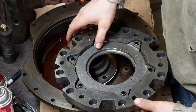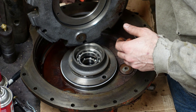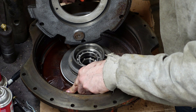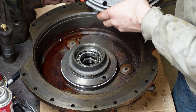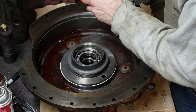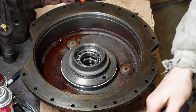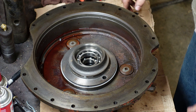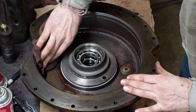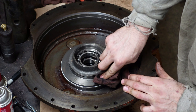Now it's got a stamp: 59. Looks like there are three little flats on here which correspond to the three brake cylinders. This piece has a seal inside. The surface that it rides on looks quite good, so that's a good thing. I'll soak this up a little bit — ATF. Makes sense; it is an automatic transmission.